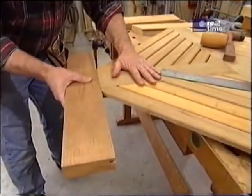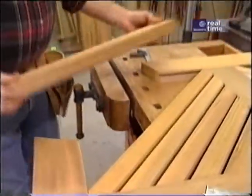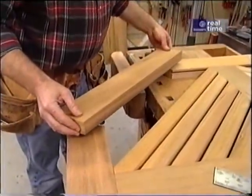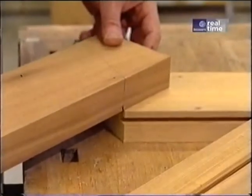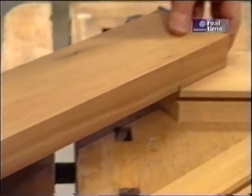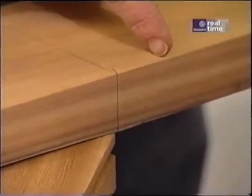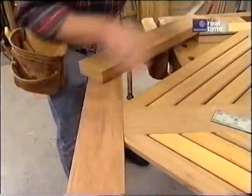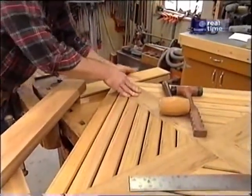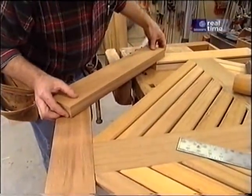Here's the second piece, which I'll also line up on the center of the cross piece. And here's a piece without a groove that's going to fit between the two segments already cut. I've laid out the theoretical measurement of what it should be, but as you can see it's slightly off — this piece needs to be a little bit longer. I simply can't make it longer, so I have to compensate: slide one piece a little bit closer, slide the other over just a bit, and make this piece just a little bit longer. These are very fussy measurements if you want it to come out right.